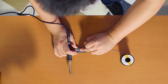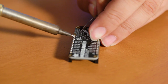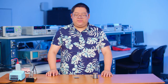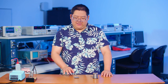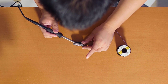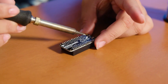I'm going to go ahead and move on to the next side. After a closer inspection, the first four that I did didn't have an adequate amount of solder. So I'm going to show you how to add more solder. You can see that some are more filled in, but this one right here you can still see the pad and the hole. To fix that, we're just going to add more solder.